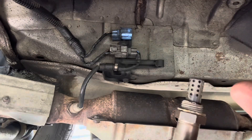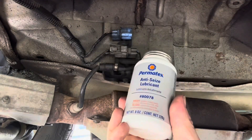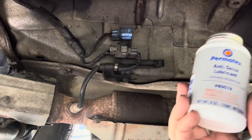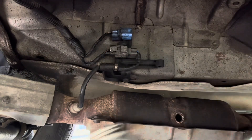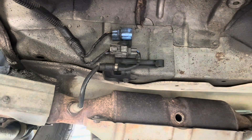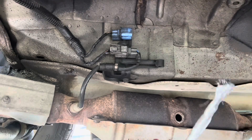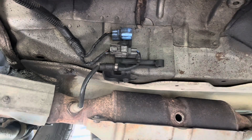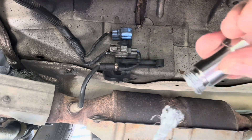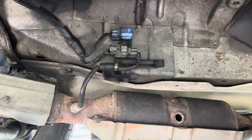Because we're taking it out and putting it back in with this extra piece added to it, I've got some more anti-seize that we're going to be slathering on here. Because this piece we're putting in is stainless steel and the other pieces are steel, when you're joining dissimilar metals they can gall. So you want to give it a little insurance against it locking completely together. Just a little never-seize on there — a little bit on here too.